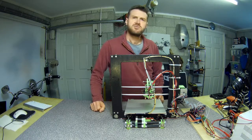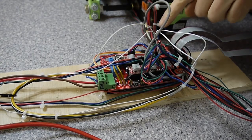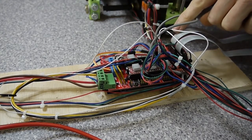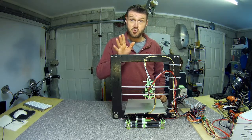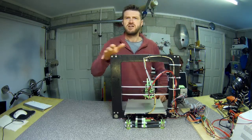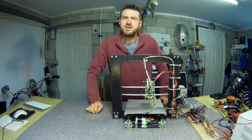I had to dig around to find the pinout for the limit switches on this particular RAMPS board. On the silk screen it says something like S, negative, and plus. All of the limit switches I had are green, black, and red — green is signal, black is negative, and red is positive — so you just need to line those up with the silk screen on the board.